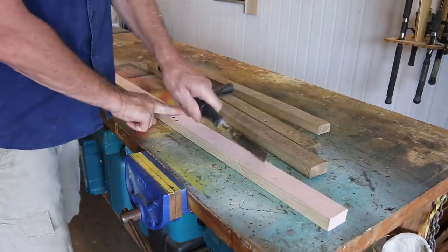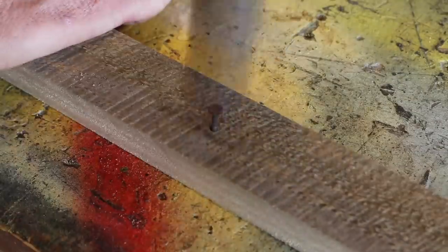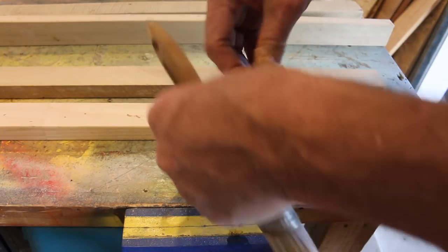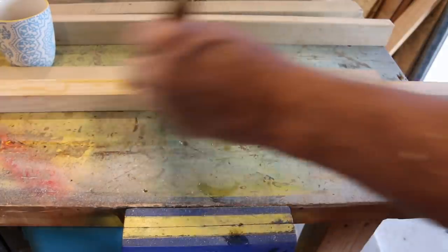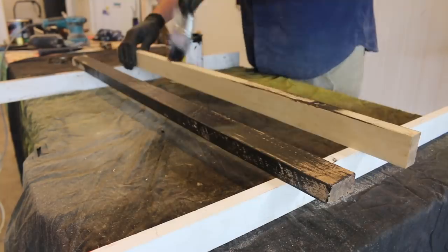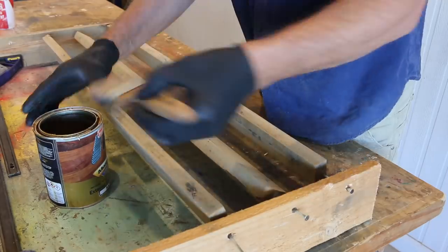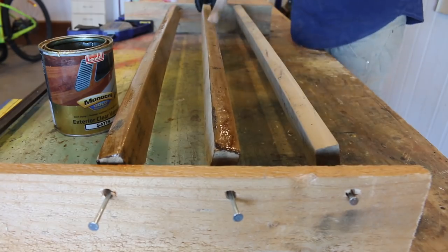With most of my projects, I like to do a bit of Uncle Knackers approved rustification work, which involves adding a few self-inflicted, character building nicks, cracks and scratches. The pine fascia board that I've cut the size is looking a bit too fresh. And since I've just made myself a cuppa, if I just paint the board with the tea, hopefully the tannins in the tea will make it a little darker. Adding some black paint and then sanding it off will help highlight the imperfections. Finish the boards off with a couple of coats of clear varnish or polyurethane, and we're ready to cut the size.